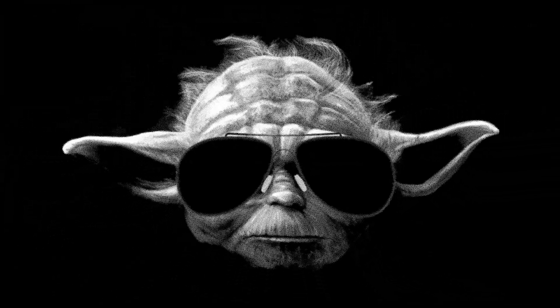Color is a major determining variable when it comes to the price. So why halftones are important is because you can use halftoning in a design to get tonal differences while still using one color print. What you're seeing here in the face of this person is all the variations — from the darkness in the glasses to the shadowing on the forehead to the different color variations in the hair. We've achieved all of that with halftones. So what halftones are is a fine dot pattern. If you really look close to this design, what you're going to notice is that there's not solid ink anywhere where you're seeing black come through or shadowing — you're going to see little tonal dots. Really tiny dots really close together that you can only see when you're very close to the design. Farther back, how it would typically be viewed, it's just going to look like it's all part of the design, and you're just going to know that you can see the tonal difference.